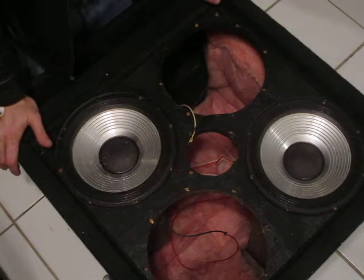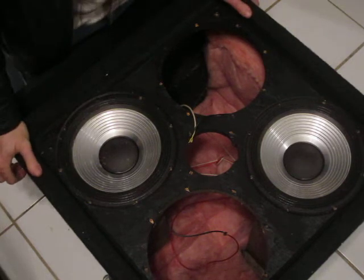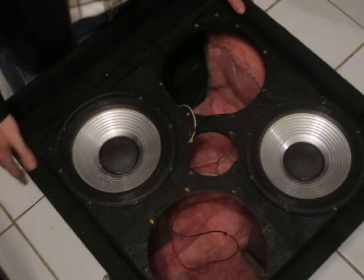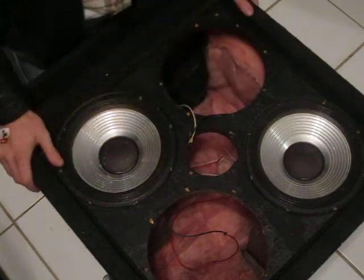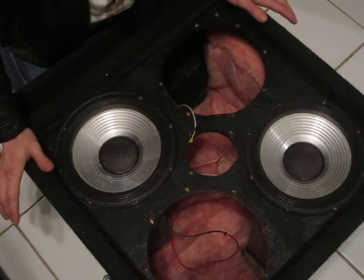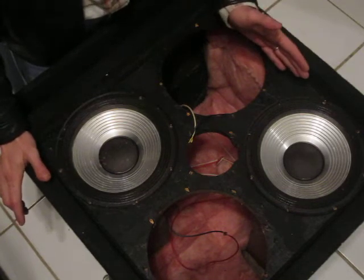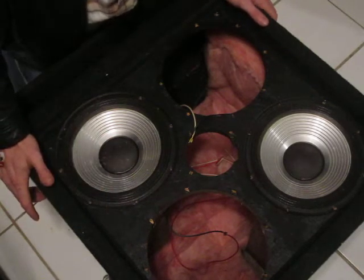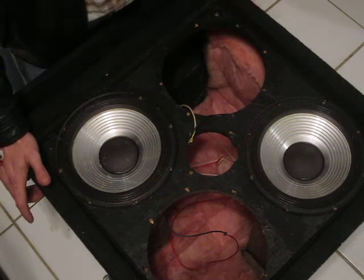It's John Gordy, and we're doing the Hartke 4.5 extended low cab. We're doing 3 speaker replacements. I got stickers on my hands. The way these are wired up is very interesting. They're wired in series per chamber, vertically. One side is wired in series, the other side is wired in series, all going to the same spot. So this is how we're going to do it.